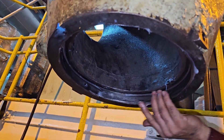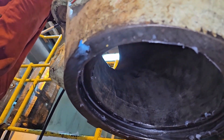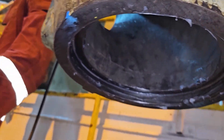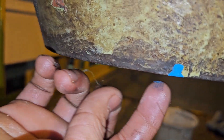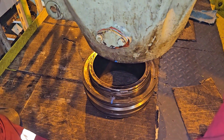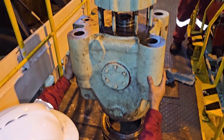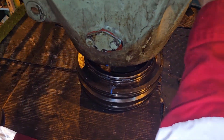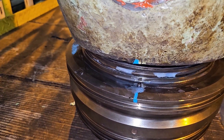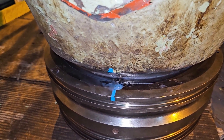Apply silicone grease completely, then lower the exhaust valve cage very slowly so that it matches the double pin. You can see the hole — I made a blue color mark, and the double pin is also marked — so that when you lower it, you can see whether the double pin is inside the cage or not. Lower the exhaust valve very slowly using a proper lifting tool. I am adjusting the cage just by the blue color paint marker mark.